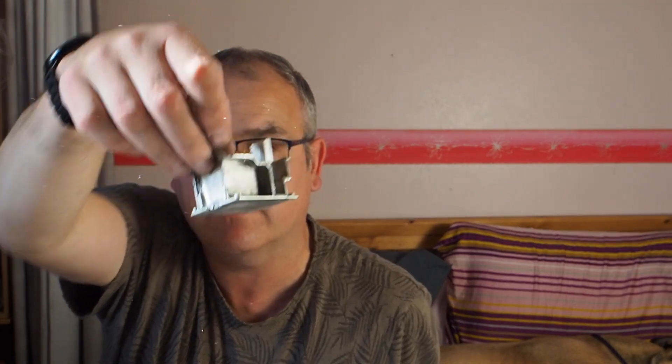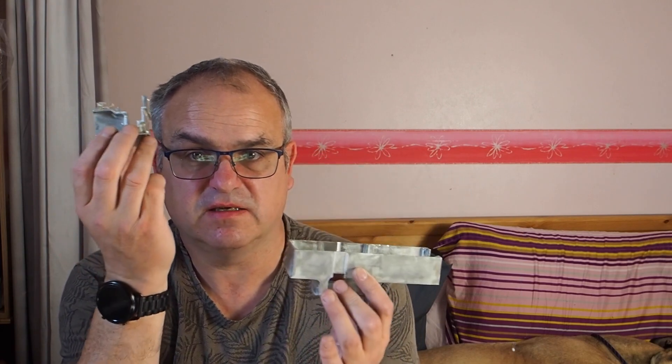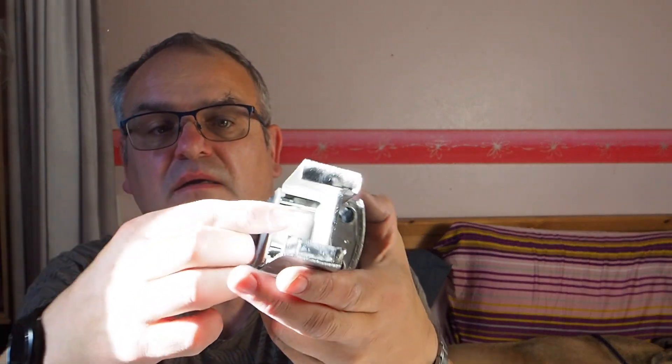This casting does need quite a bit more work. If I hold it up underneath where the doors are, you can see it's inset. Those cast bits have got to fit over the cab — if you remember from the last program we built this — so they needed quite a bit of work. Check the fit and keep going until it just slides in nicely.